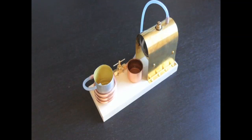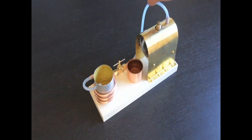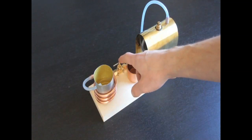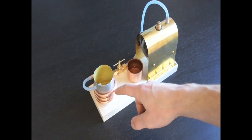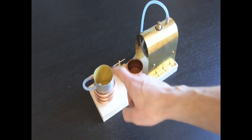Alright, here's my desktop steam boiler. The main parts of it are the boiler, the fill valve, and the fuel tubing, which runs to the main shutoff valve, which then runs through the little radiator core, and then spits it back into the little infuser cup.